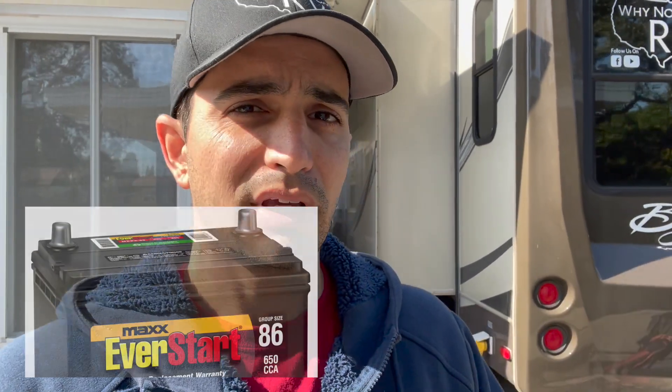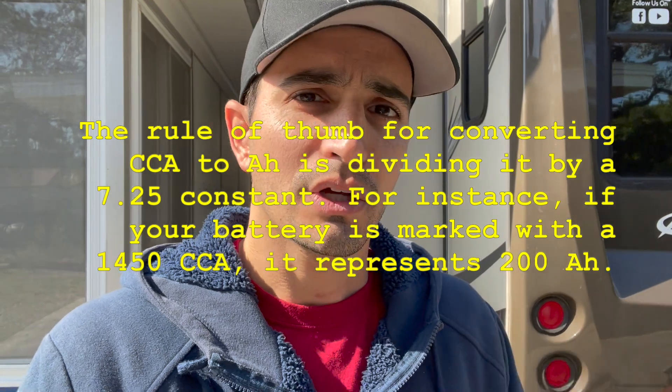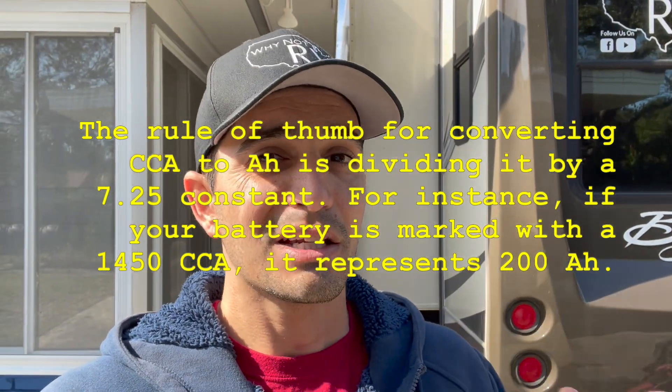Batteries are usually rated in cold cranking amps, CCA. That's just an easy way to know what size the battery is. There are a thousand different ways — group 27, group 31, 4D battery, 8D battery — all those different things tell you more about the amp hours and capacity. But generally speaking, a lot of lead acid batteries are rated off of cold cranking amps, and that doesn't really tell you anything. So you need to figure out your actual amp hours. I'm going to put a formula on the screen right now for converting cold cranking amps — CCA — over to amp hours. Because when you're looking at a battery that says 750 CCA, that doesn't tell you how long the battery will actually last when you're trying to run your refrigerator, your pump, or an inverter. So you've got to figure out your amp hours.